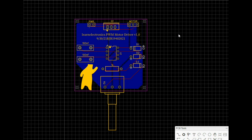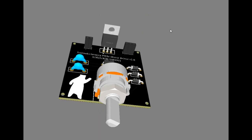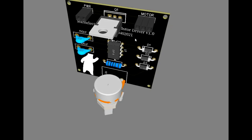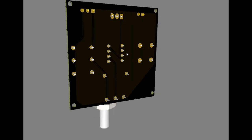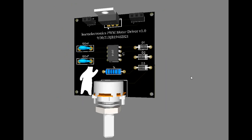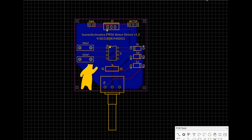Here is our circuit board — it looks pretty simple. I had a hard time finding a footprint to fit one of my potentiometers so I'm going to have to draw my own. There we have our timing diodes and our flyback diode. There's our completed board minus the heatsink on the MOSFET. You can see I did a ground plane there, so everything looks good. All that's left now is to order up our Gerbers.